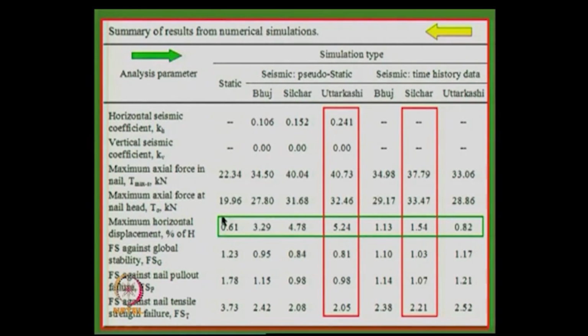And of course, the best is to also do a conventional analysis, because we should always do this and that. It always gives a safer value, to protect ourselves, that yes, I have used this method and I am giving a safe value. But this will tell you how safe you are, to some extent, if these calculations are correct. If you are wrong here, then it is very risky, but at least you cannot be wrong here, because in the conventional method it is just calculations. But in finite element analysis, you can go wrong in numerical analysis and boundary conditions. One should be very careful. If you do this sort of analysis completely, it is possible to say where the numbers are falling.